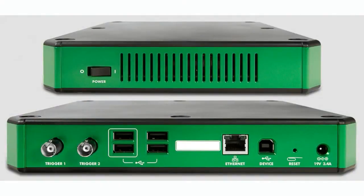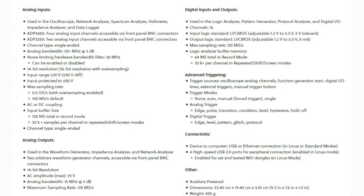So there are a lot of specs here. Basically, you've got two or four channels, 55 megahertz bandwidth. There's oversampling that gets you about 400 mega samples per second; without oversampling you have 100 mega samples per second. Plus or minus 25 volts, 50 volt protected input, 128 mega sample record mode. You've got analog outputs, digital inputs, advanced triggers — there's kind of all this stuff. It's a little bit like a bento box where you get a little bit of everything. Even though it's called the Analog Discovery, it does digital stuff as well.